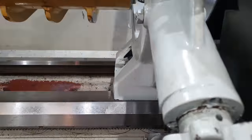So this is a piece of plate I'm going to use as my counterweight. If I put it on one way, it's going to fit really well, but that would mean I would have to drill holes in it and use threaded rod to attach it onto the strut. It's actually for something else and I don't want to drill holes in it. So I'm going to turn it the other way. I'm going to make up a clamp that goes over this piece of plate down through the bolt holes in the mounting plate for the strut.